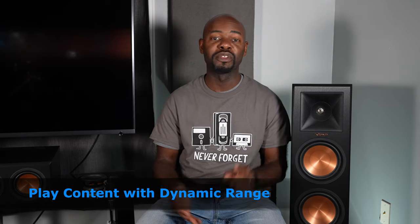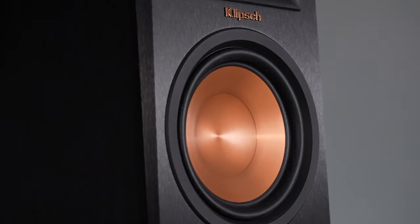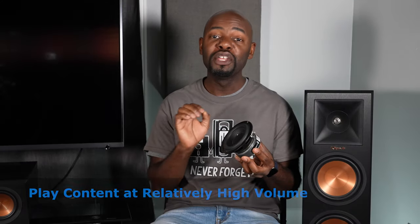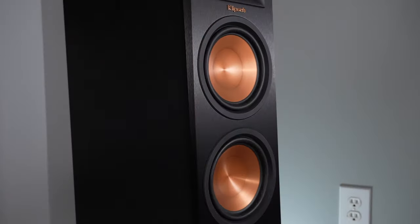The second tip is all about content. Whatever media you're using — music or movies — you want it to have nice dynamic range, meaning high highs and low lows, because you want to work the driver system in and out as much as possible. Do different types of music and movies, making sure you're working the bass, mid-range, and treble through various frequencies. For volume, you don't need to set it at 10, but around seven or eight gives you plenty of excursion on the speaker system, providing a nice stretch on the surround and spider.